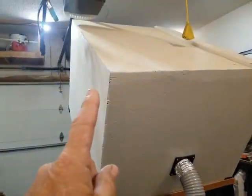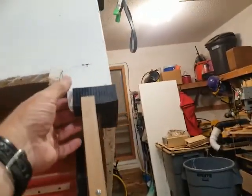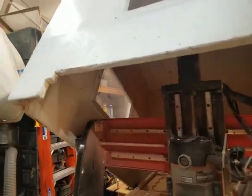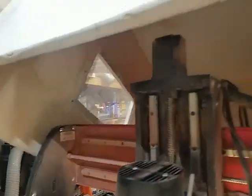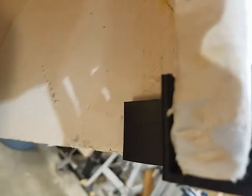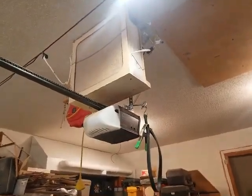This is a baffle — the top part here is a baffle that reduces the sound, and that was well worth its weight. The box is well worth it too — it keeps the dust down and some of the noise down as well. If I really wanted to go soundproof, I'd just build another box and put a piece of plywood on it and build another box over it. This box doesn't have anything inside it. I see guys putting all this stuff inside, but it's always going to be raining down sawdust. If you fill your CNC enclosure with foam, it's going to be one big mess every time you open it. Keep it clean and vacuum it out every now and then — it just basically works like a big ice chest that sits over the top of the machine.